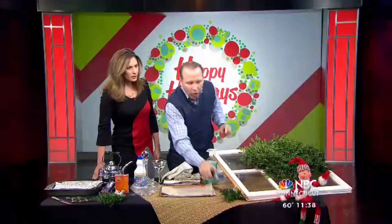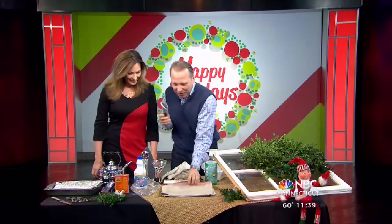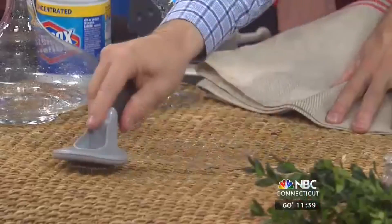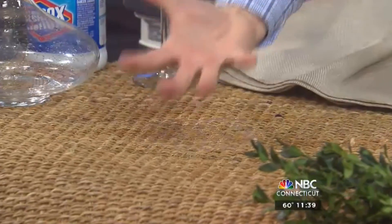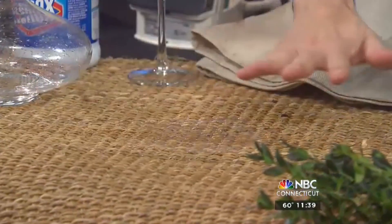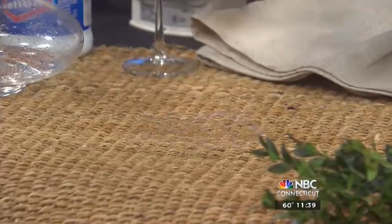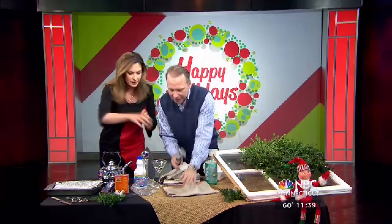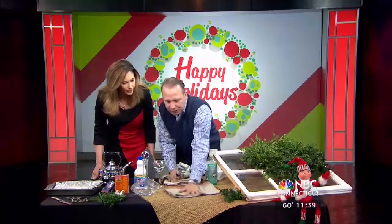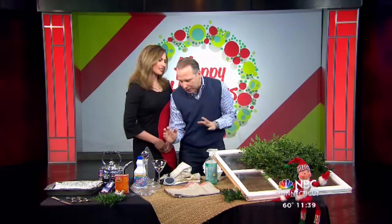Here's the trick: you take a wiry brush — this is for my schnauzer, Violet. What you're going to do is go over the grains, and you'll notice with sisal carpet, because it's very natural and organic, it will pull the color back up and it will match the rest of the sisal carpet, removing any stain. The problem is the moment you put any chemicals, water, or remover, you're done. By now, we've dumped on gallons and it's not coming out. Just let it sit — be patient with it. It works every time.